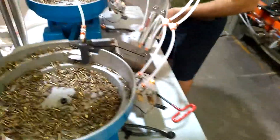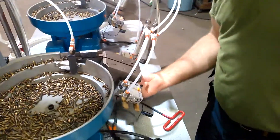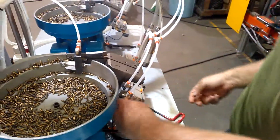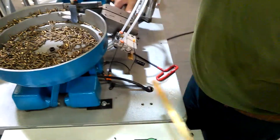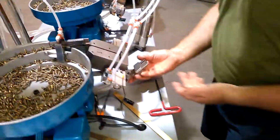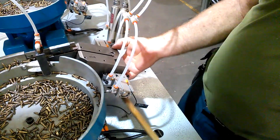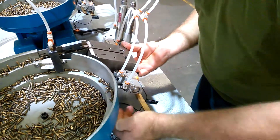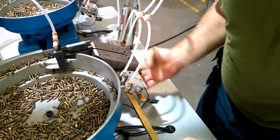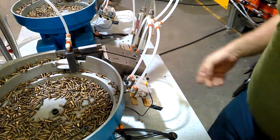We're going to turn the air off. That slides back and forth nice and smooth — just checking to make sure mechanically it's good. If we wanted to take it apart, you don't need tools. You just slide this brass piece over and pull that out. This piece comes right out — clear any issues. Slide it back in. You can put this back in and you'll actually feel it. There are little detents in it and it'll lock in place. The detents line up with the holes in the brass. If it's a little off, it's actually not going to hurt anything. Then you can check it again to make sure it's sliding all right.